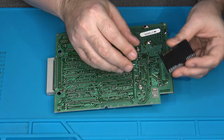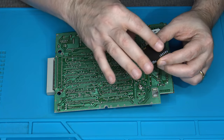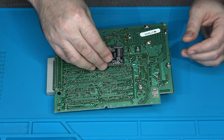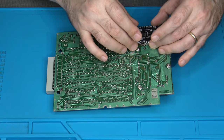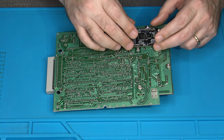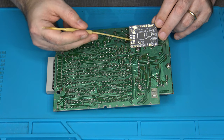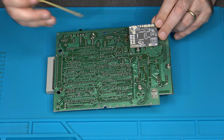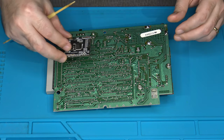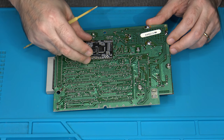So what I would recommend is to get some sort of insulation tape to cover the back side of the board, and then whatever other method you decide to use to hold it and fasten it in place. But you want to take into consideration where you need to put your outputs. Keep in mind that in this particular install, these are the input pins and these are the output pins. Since this is the back side of the console, it might actually be better to try and find a method to mount it on the back side off to this direction here.